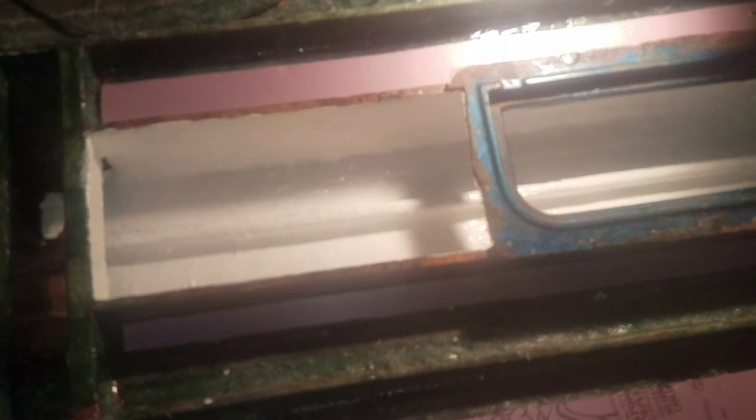The second coat was a little bit easier. I used the milled fibers to thicken it up and it ran a tiny bit in some spots. Since I didn't have the PVA, I just used Rust-Oleum clear enamel gloss and it seemed to do pretty good — tack free. It looks wet right now but it's got a pretty good little gloss to it.